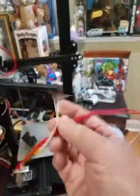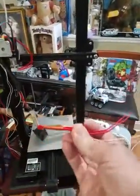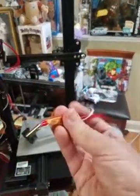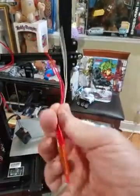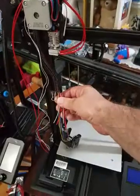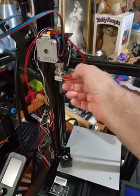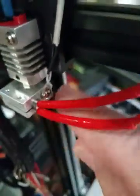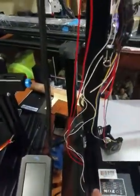I will check the heater cartridge. This was new, and this was new — both of these were totally new. Right now I could have tested these prior to snipping them off, but haste makes waste, so I'll check those out later. What I did was a simple test: I cut them off and installed a new heater cartridge and a thermistor. There's a heater cartridge and a thermistor installed. I placed those in there and went directly down to the motherboard and connected them.